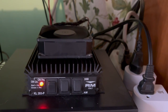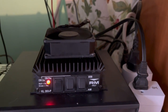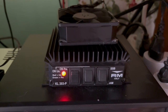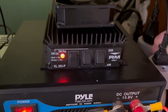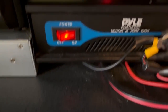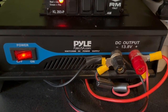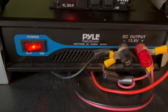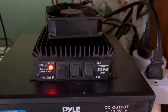So there you have it — a quick and inexpensive way to construct a cooling fan for your amp. One other option: if you didn't have a power supply brick from an old laptop or Chromebook, you could wire the fan directly to your dedicated radio power supply. The only disadvantage is that it would be on all the time, though you could work around that by putting a little switch in the wire. There you have it — a cheap, inexpensive way to cool down your amp. Thanks for watching and I'll see you next time.